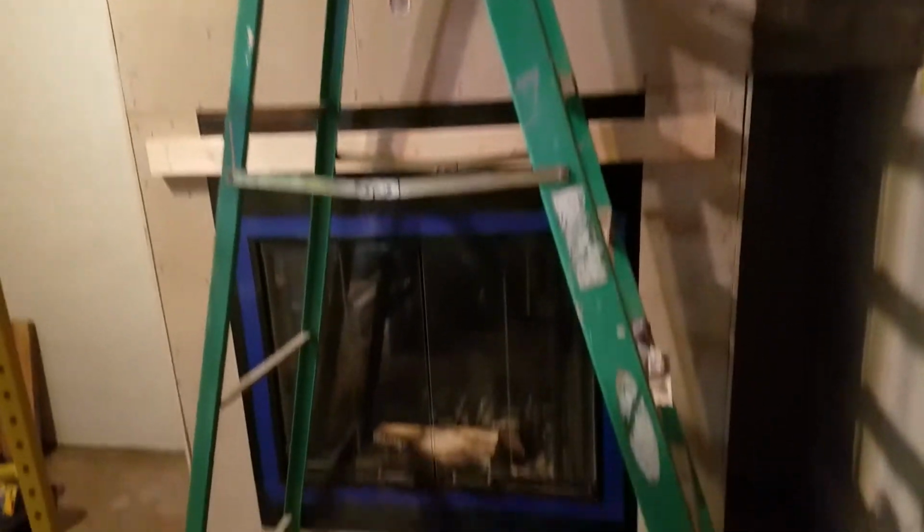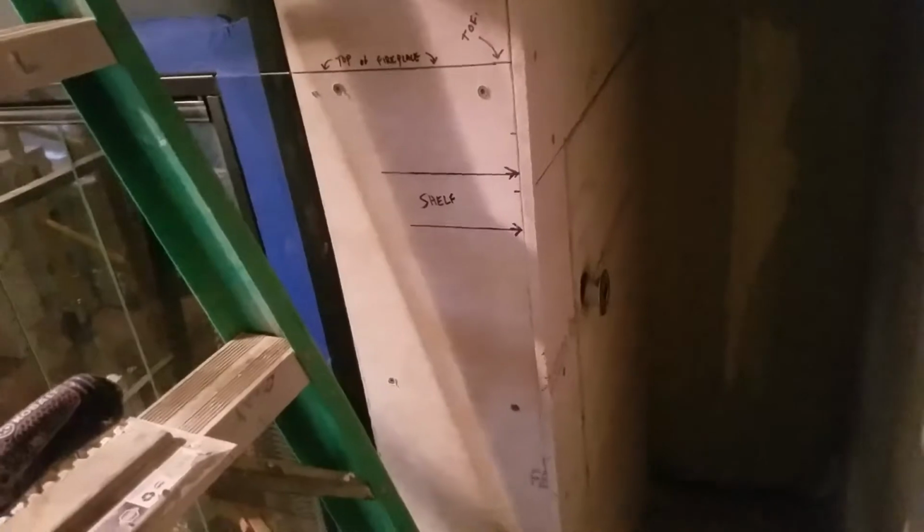And then it's veneer time. So we'll be coming in with veneer. The veneer will only go up about 3 foot per day as per the requirements on the mortar. But we do have our shutoff here for the gas side. We have a pipe here that allows you to fish the wire up and through to the back of the television. So that's nice. That side goes over into the utility room, so we wanted to make sure we maintained access there. That'll all be cut around.